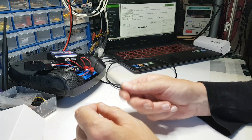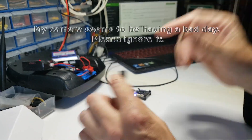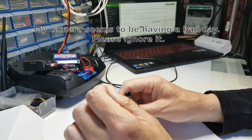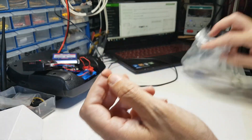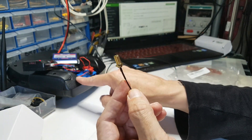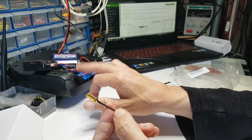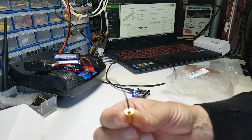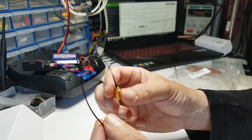Do you remember me telling you that when I use my transmitter and I'm flying around — I'm just going to pull that out because I see it's charged — when I'm flying around, it feels like there's something wrong. I get to a bit of a distance and it feels like I lose a bit of control. I've now found out why. The problem is these cables — this size wire. This is the sort of pigtail, the average sort of size. Maybe slightly bigger are the ones that come with the mod kits that a lot of us have bought to mod our antennas, to get external antennas. They come with these little tiny lines — and this is the problem.